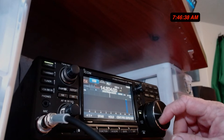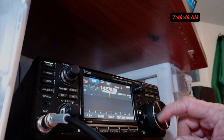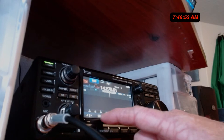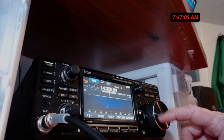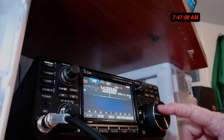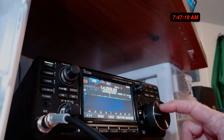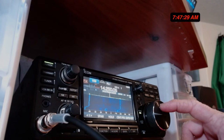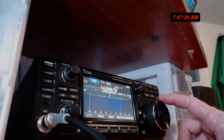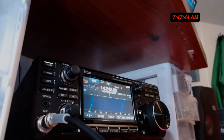All right, we're going to take off the lock on the rig. Something I do, and this is not the wrong way or the right way to do things, I will try and go near digital mode. I will try and go near someone else that's got a good signal. The reason I do that is because people will hunt there for a waterfall. Those are FT8, or digital, sorry. There's something right here. Looks like somebody right here, probably at 50. See, 20's coming alive now. Okay, good. So we're going to go down to 14.246. 14.246 megahertz. If you've got your radios there, 14.246, let's see how we do it. Move my amplifier to 20 meters. Just one second.